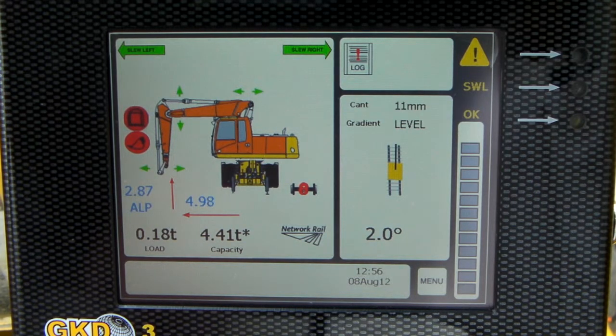I've currently got 180kg as my load on hook, which is the weight of the Quick Hitch. In terms of the machine, I have got a large weight which weighs about 3.15 tonnes, and I'm about to lift that weight off the floor.